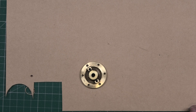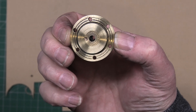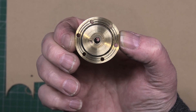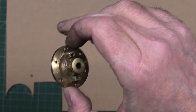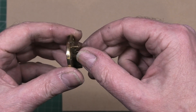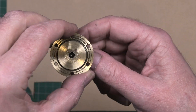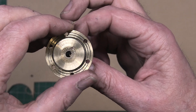I'm just cutting the gaskets for the cylinder end caps. That's a cylinder end cap, I think. I'm slowly getting there on the names. The piston goes in there and inside that goes graphite yarn — not grease. I've actually put some in there but I've taken the piston out again so I'm going to have to redo it.